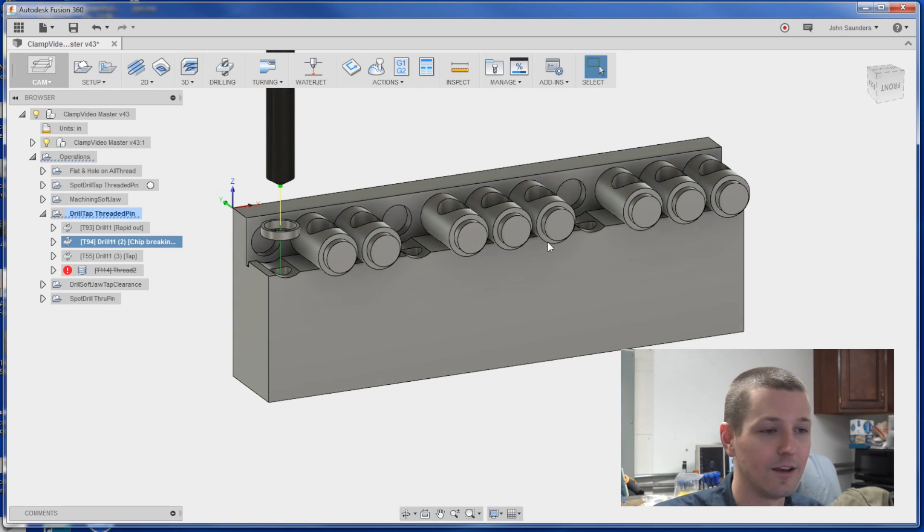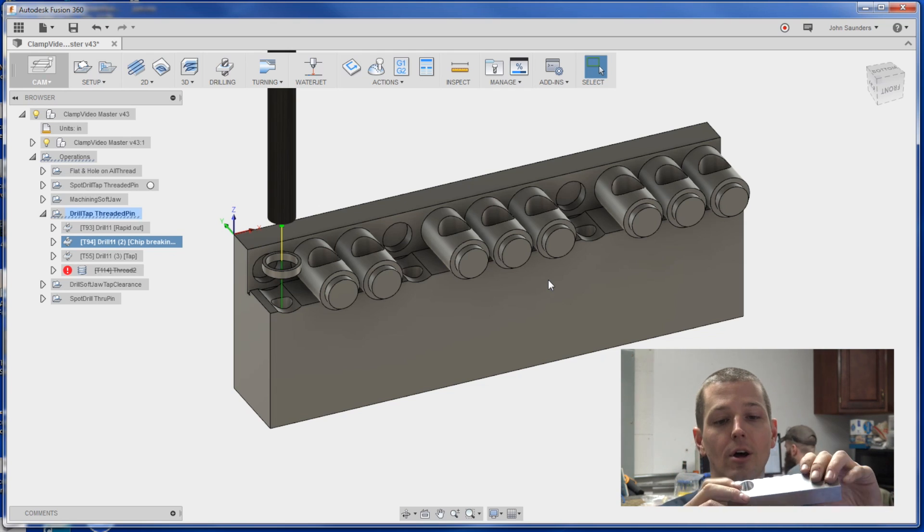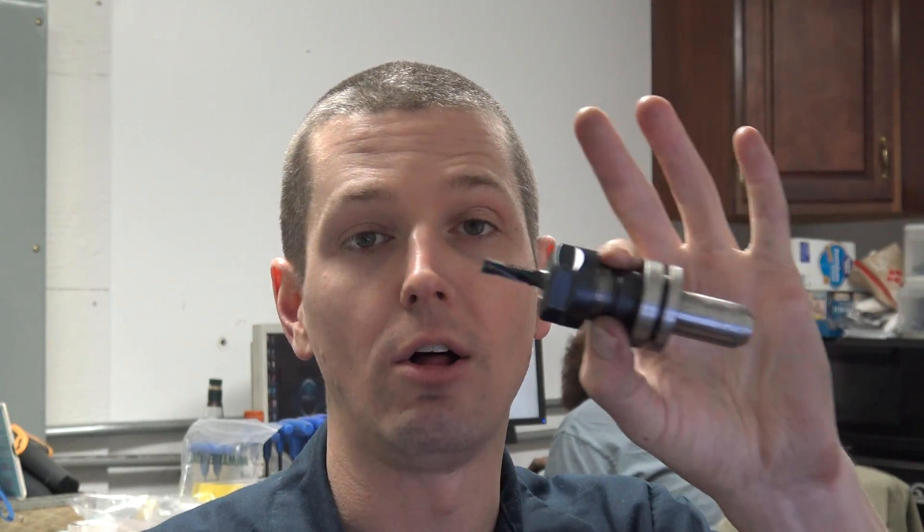This is a good lesson as to why you always want to model stuff out. I took the time to create this set of soft jaws — I was proud of it — but I didn't model my holes. These are the monster jaws that reverse, and I love them, except you have a slightly taller slot, which means less meat here. We really can't tap a hole in positions 2, 3, 9, and 10 because there's just not enough material. The workaround is to thread mill all of these — and I actually like it, because I want a looser fit so the clamp has a nice motion.